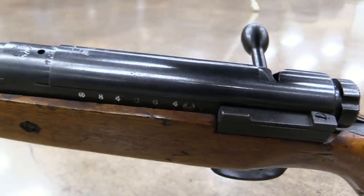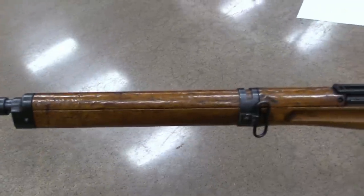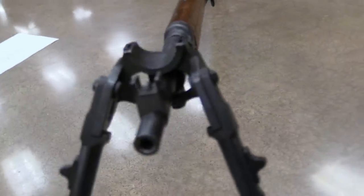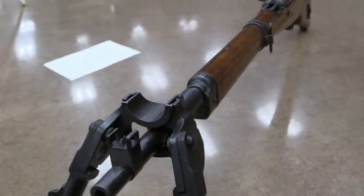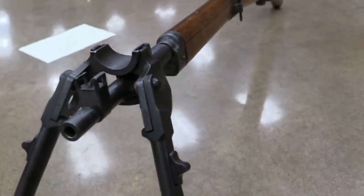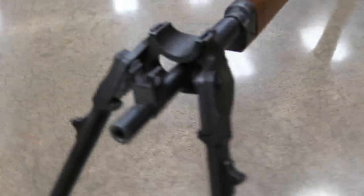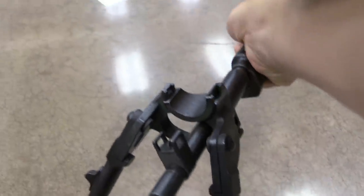This is a first series Nagoya rifle. You can see the serial number and the arsenal marking there. It appears that the monopod block was actually ground off the bottom of the band, and the front of the stock was cut down to accommodate this bipod mount. On the normal Nambu machine guns, this opening that the barrel is going through was actually an opening for the gas block, and this was the bottom half of the attachment point for the barrel. With this conversion, the guy who made it added a sleeve around the barrel and ran the barrel through the gas port opening.